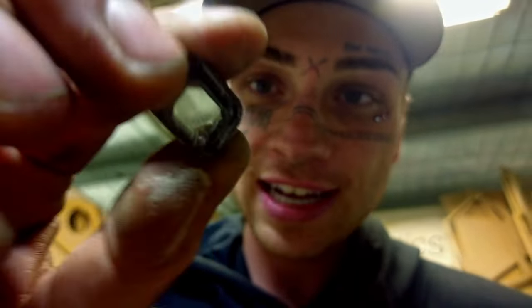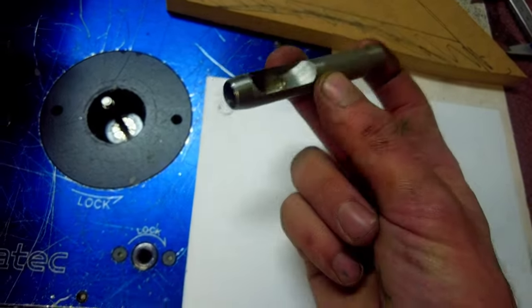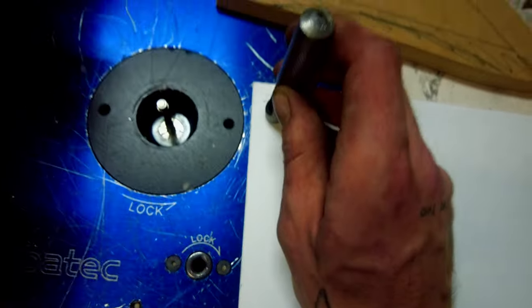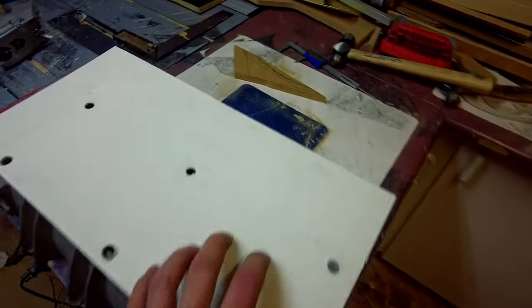This little lens thing just fell into all the dust - it's inside it now, I'll have to have a look at that tonight. I'll keep putting it back on for now. Sorry, half the video has probably been real dog shit. I just got the first mark, and then I remember we have these little hole punches that are the right diameter. I'll put it on here, tap that hole out to get a nice crisp hole, then copy it. All the holes are punched out.